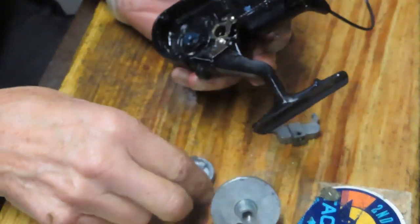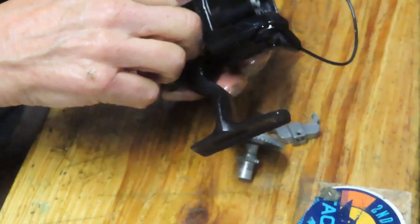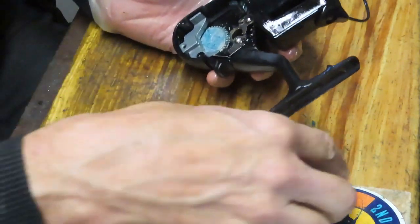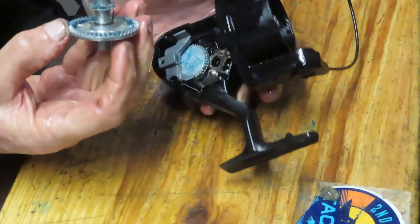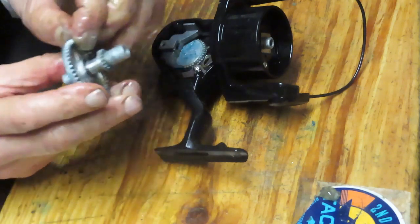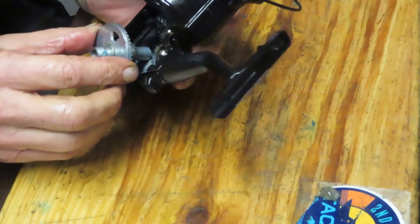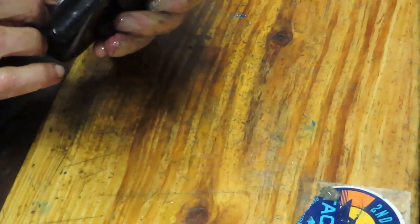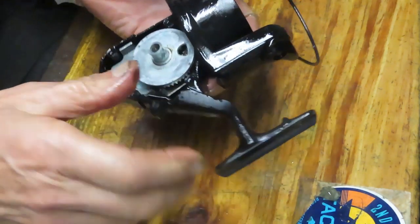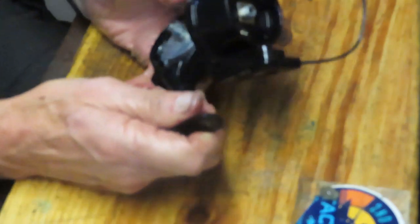So that's how you're going to run that piece. Well, the other pieces fell out, so let's go put those right back in. Make sure that you get that crosswind block on the stud. Time to go line up that angle again, sort of like a recap of what we just did. Let's go put that back on. Look through your hole to make sure that it's aligned with that hole in the stud.